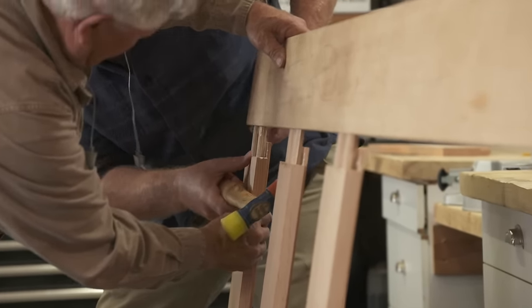All right, so we don't know whether or not the homeowner is gonna stain or paint the door after we install it, but for now I'm just gonna spray a little bit of a wood preservative on it to protect it. Once it's dry, you can do whatever you want with it. It's really nothing but a borate-based mineral. And that's the wood preservative. And you notice I didn't put much on at all. It just requires a very thin coat.